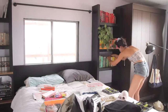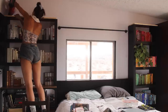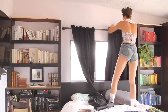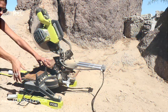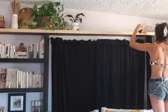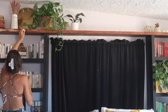After styling for a bit, I went ahead and topped each of the lack shelving columns with that pine we distressed and stained, using my 18-gauge cordless Milwaukee brad nailer. Then I added a lip to make the piece look a little larger than what it is — people are going to freak out about that, but it works great. Also listen — when it comes to staining the way I'm doing it right now, I do not ever recommend that. Stain it before you install it. I don't even know what my brain was doing right there.